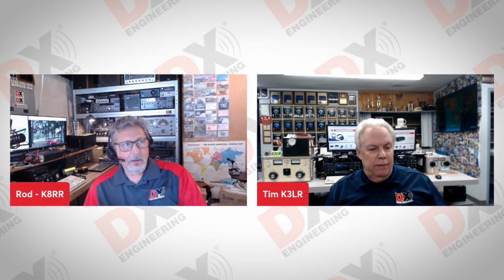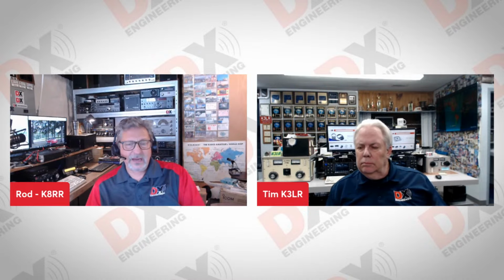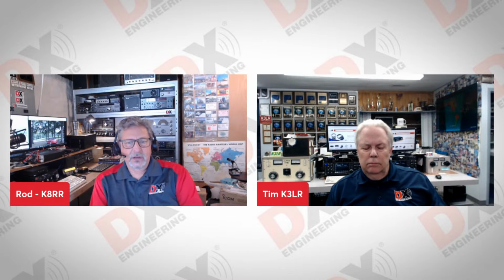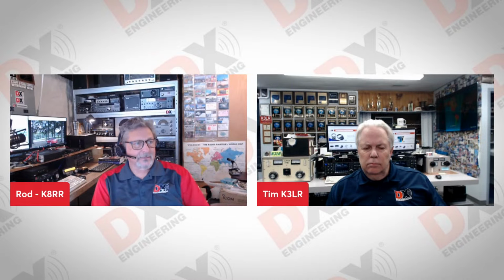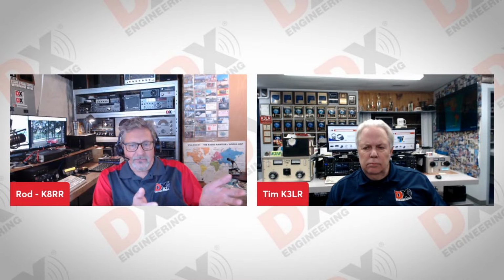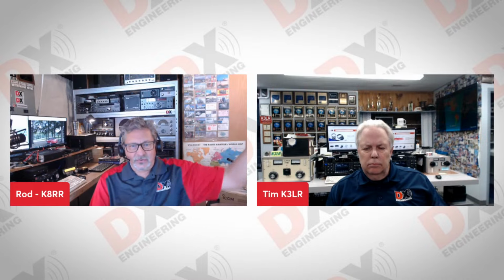It really does. I've had receive systems, and I know you have talked to a lot of customers about that. That's right. Noise is an insidious thing, and you don't really know if you have it. There are going to be cases where somebody could install one of these chokes and they don't hear the difference on a particular day, but you don't know when some noise is going to propagate in and affect the system, basically raising the noise floor of the entire receive system. And it just kind of happens gradually as the sun sets and the noise starts coming in.